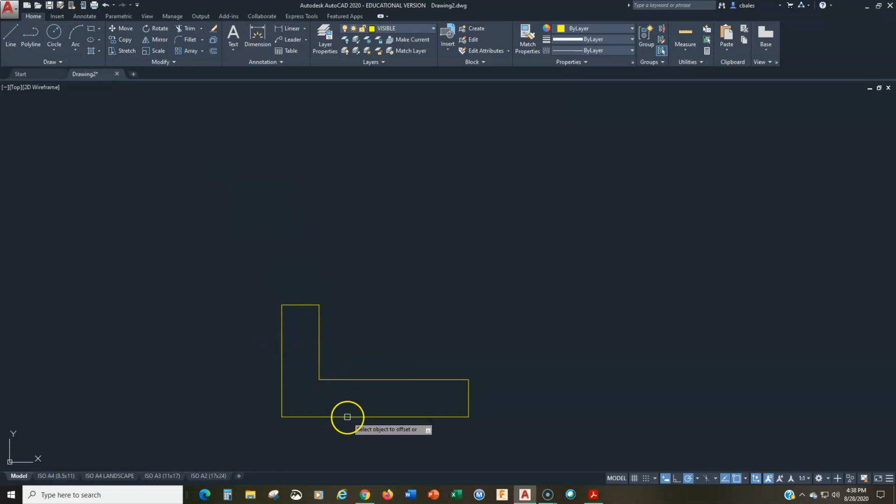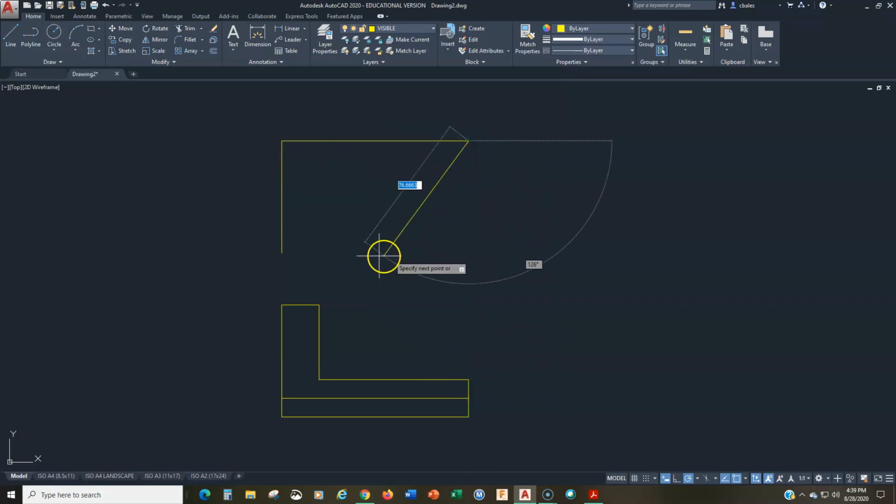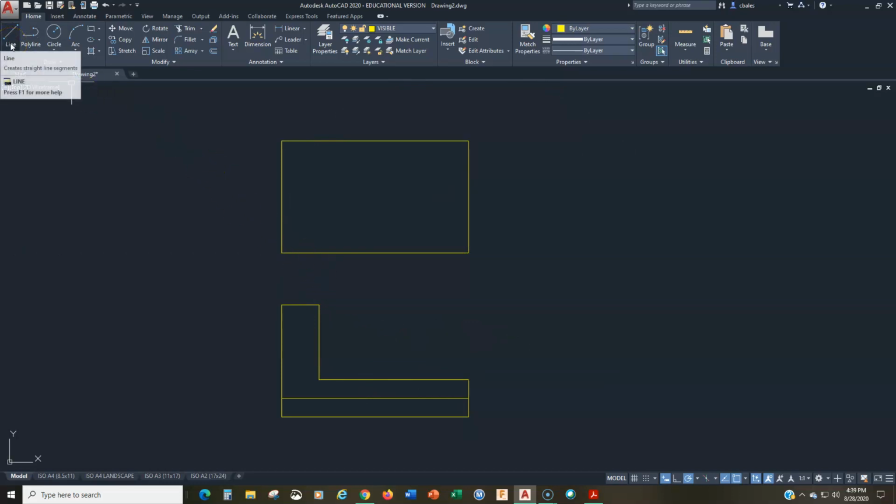You don't have to do that, and like I said, oftentimes when I'm drawing, I'll mix everything together. But let's draw the top view now. So the top view, I'm just going to project it up here, and then go, let's see, 60. I really hope that you can practice this technique of projecting the lines across, because it really does speed up your drawing. It actually makes it more accurate because you're using geometry that you've already drawn. If you've drawn it right the first time, you're going to continue to draw it with those dimensions. Of course, if you draw it wrong the first time, then you're just going to propagate those errors through.